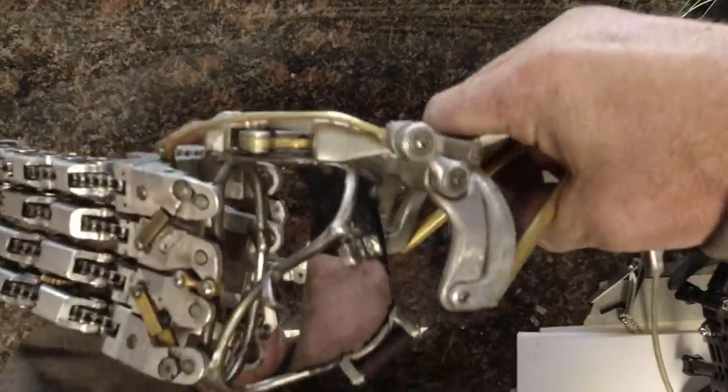What I've been seeing on multiple builds lately is where you have the primary and secondary axis of the gimbal backwards. 99% of the function of the hand is going to be opening and closing the fingers, with splaying the fingers making up a very small amount of the usable function. Splaying the fingers, while incredibly cool, is actually more of an aesthetic than a function. You need to decide for yourself if the aesthetic of the fingers being able to splay is going to be worth all of the extra work that is going to go into fabricating your device.